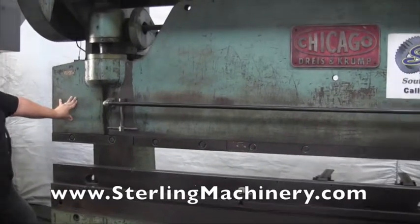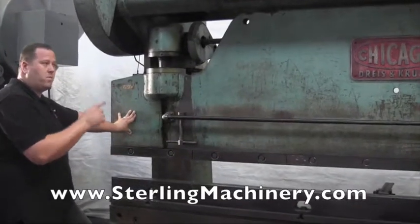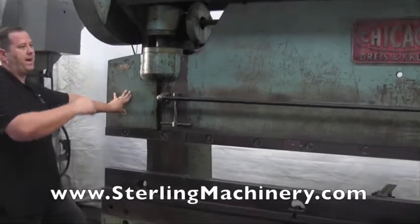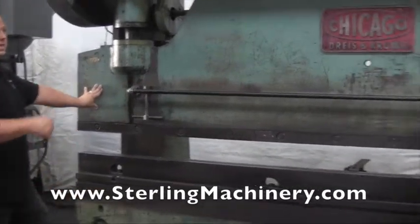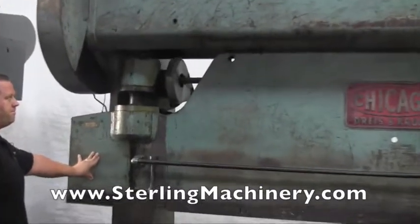But the difference between hydraulic and mechanical is that with a hydraulic, you can reverse your action, go back up. With the mechanical, you're going to have to complete all the way down the cycle before you can go back up. We'll just let you see this running for a little bit. You could hear it in continuous mode.